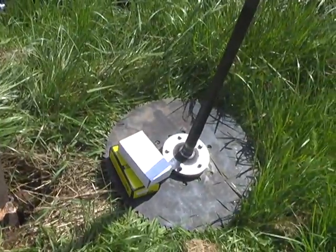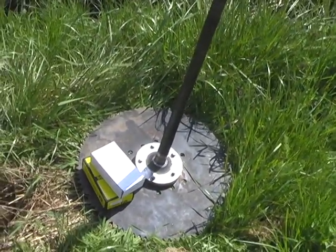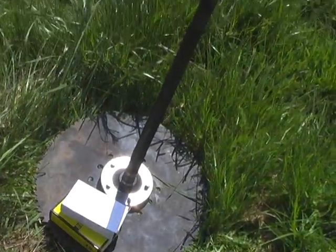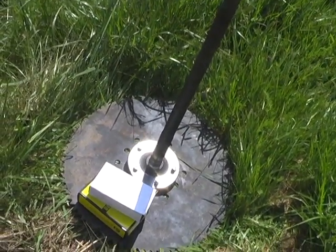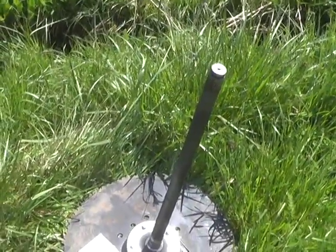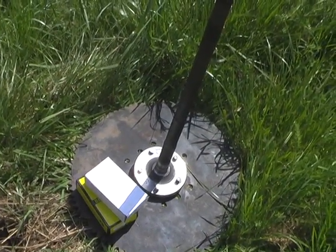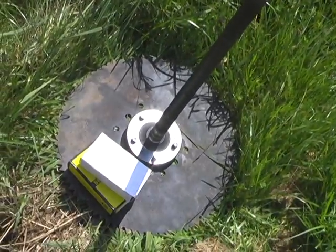I set my wood post into the hole I set into the ground. I've got the bearings here and here's my hub shaft assembly. I'm using a tapered shaft out of a Ford van, so I had to get two different size pillow block bearings rated at 200-plus pounds of axial force — pushing down on them isn't going to hurt them up to about 200 pounds. The bearing guy said that since these have ball bearings instead of flat roller bearings, they can withstand axial force, but anything more than 300-400 pounds will wear out the bearings real quick.